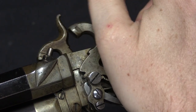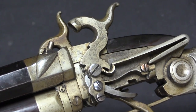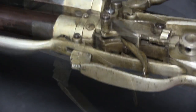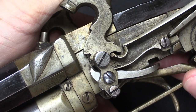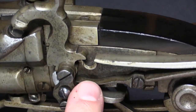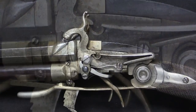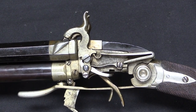That's the safety notch, that's half cock, and that's fully cocked. When I pull the trigger, it simply pushes down on that sear bar — in this orientation it's going to be pushing up on it. When you do that, this hook drops out of the notch on the hammer, puts the hammer down and fires. You've got return tension on this provided by this little flat spring right there. And that's how a percussion hammer trigger sear system works.